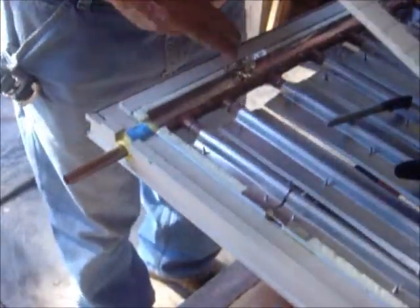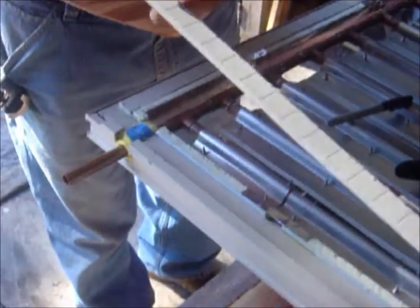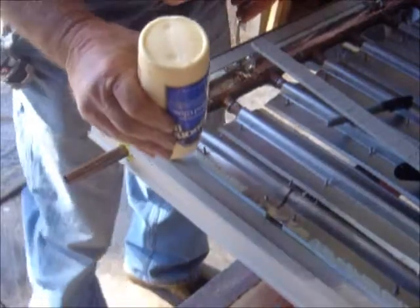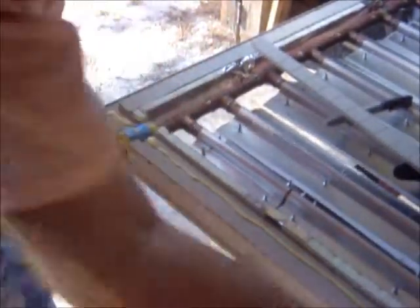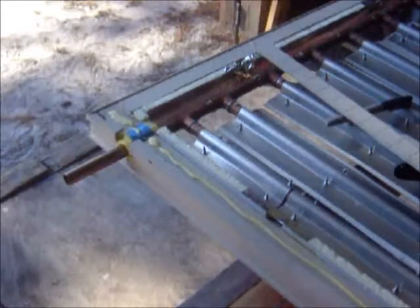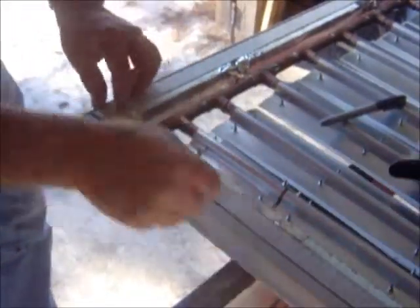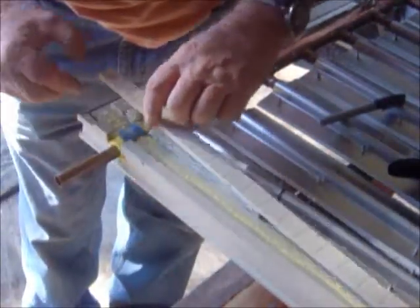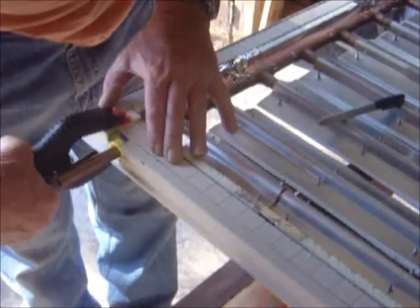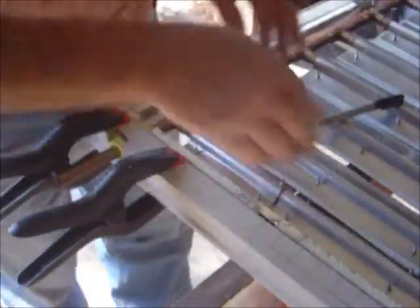Now the next step: we've got this in, tie it off, screws tightened back up, and the tape on all around. We're going to put this one-inch wide strip of hardy board onto here — we're going to do it with glue. Nice good bead along there. Put that on here. Make sure you've got all this tucked in so it lays right down. This wood glue sets pretty tight, pretty quick. Just want to put a clamp on it for a little bit, and any place that you feel is not laying down, put a clamp on it and go all the way around.